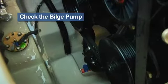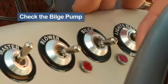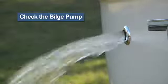While we're checking the charge, let's go ahead and check the fluid levels as well. It's a good idea to be sure the bilge pump is working. With the boat outside of the garage, hose a small amount of water into the bilge, turn on the switch, and see that it pumps water overboard. Be sure not to stand in the path of the hole where the water exits.